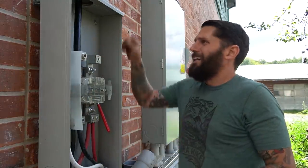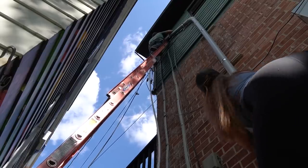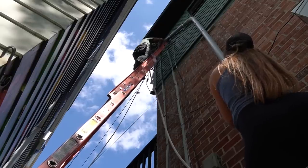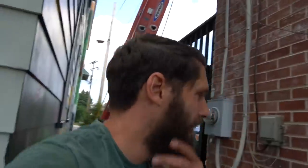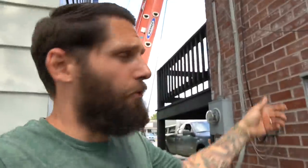I just want to see how it's going to go down with that one wire because I'm pretty high in the air and that cable's very heavy. All right — fail. I'm about to get a machine here. I've got to get all three wires through at the same time and it's not safe enough for me to do it three at a time on this ladder. I need to get a lift up here and do everything on a lift with three 600 copper wires all at the same time. I can't do it on an extension ladder with all that weight. It's just not safe and it's not feasible. So I've got to run, get the lift, put the basket up in the air, and push the entire thing down with a rope pulling it and we're done.